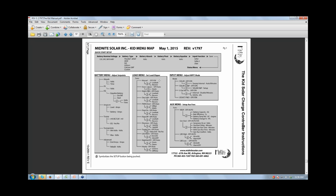Would it be an option for them to use the load circuit with that DC to DC converter, or no? Well, it's quite possible. What's your current rating? What kind of current are you sending down the line on that 1,000-foot run? I mean, you're anticipating sending 5 amps, 10 amps, 20 amps, or that 3 amp full time that we talked about? We're hoping that the load will draw a consistent 3 amps, but maybe it's peak of what, 6, 7 amps? That's 6 amps.